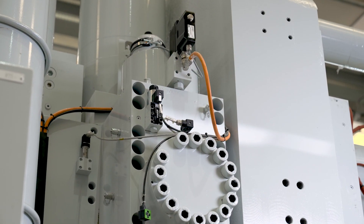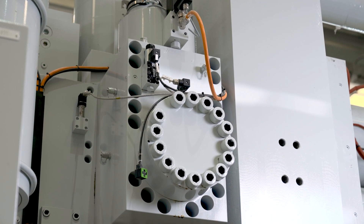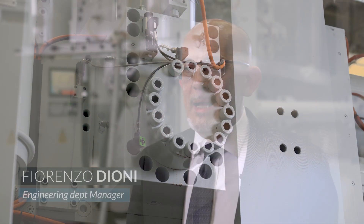Speaking of the exhaust, in practice the proportional speed control valve is no longer located in the exhaust block of the injection cylinder. In this way, we have removed many of the problems associated with turbulent flow and high pressure differential through the speed control valve in meter out. Now it works in meter in. This results in smoother movement and less erosion, longer life for the valve — in this case TDP, but could be a TFP — and the injection cylinder itself.